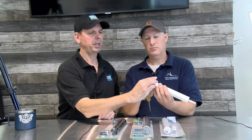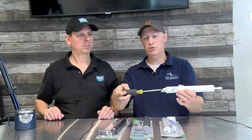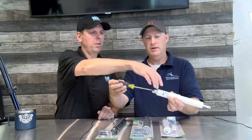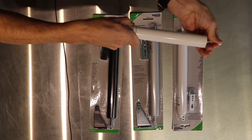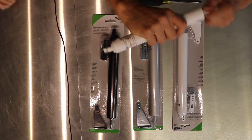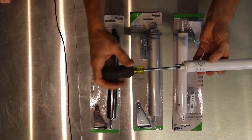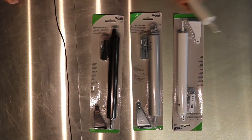There is an indication of slow or fast on the label. If you want it faster, you give less pressure — so you're unscrewing it. You can show it goes all the way out. With very light pressure, it's easier to pull out — that's what's happening. If you want more tightness, if you have the glass in and it's heavier, you tighten it up. Usually you make an adjustment, open the door like you're going in the house, then go back out and feel or watch how fast it's moving and make some tweaks either faster or slower along the way.